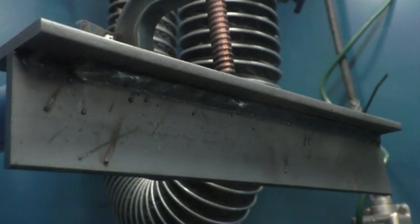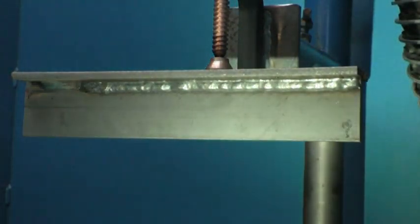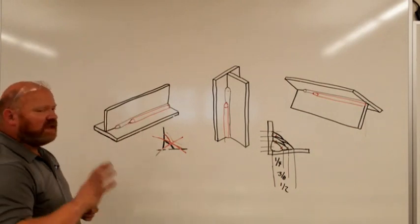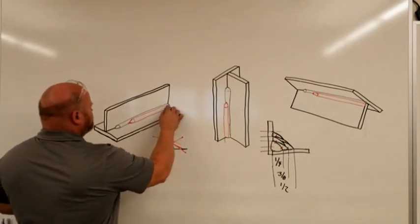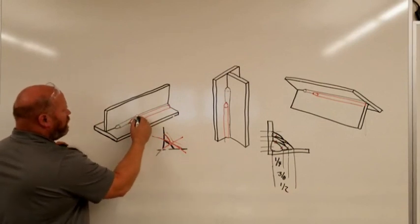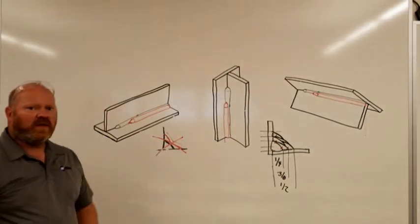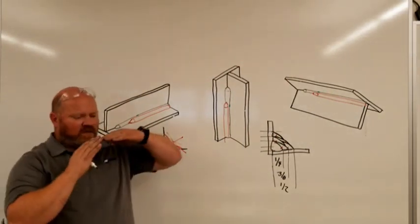Same on the overhead — the wire is not pointed at the lower corner, it is pointed on the weld slightly above the lower corner. Gun angles stay basically the same; the MIG gun is pointed more or less up, not out at 45 degrees but perhaps 20 degrees or so. The wire should be slightly inboard of the original toe of the weld. A little bit makes a difference — in this trade, the difference between a great-looking weld, an average-looking weld, and a garbage-looking weld comes down to itty-bitty-tiny variations. Give the same tuned machine to a pro, a new guy, and a rank amateur — you'll get awesome, middle, garbage.